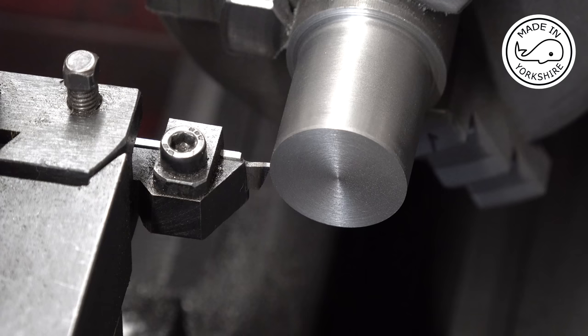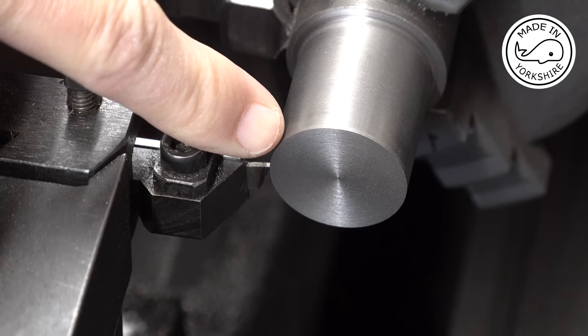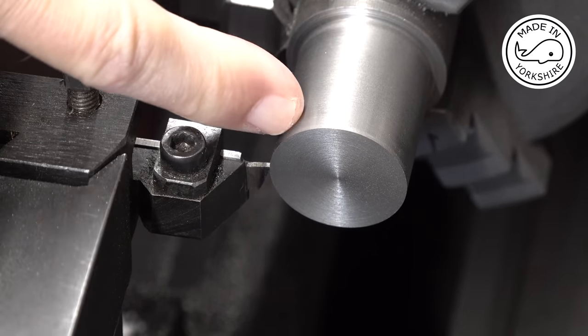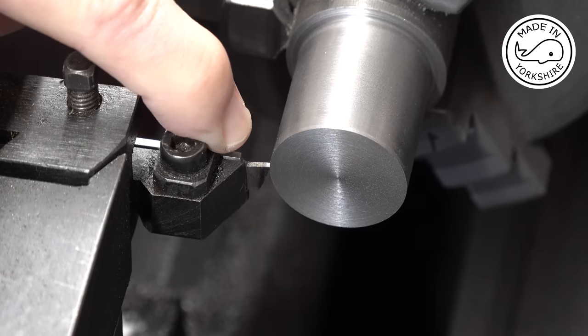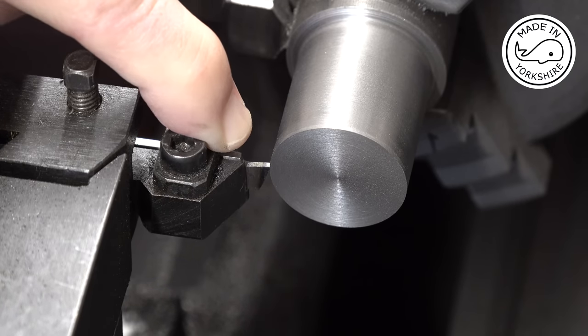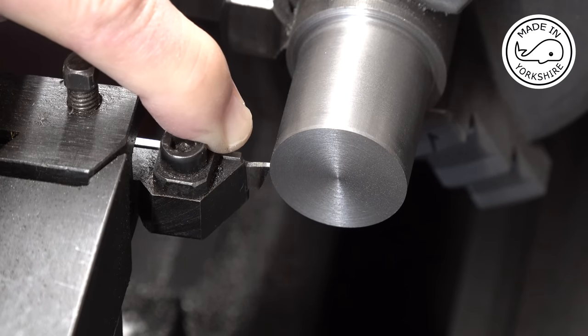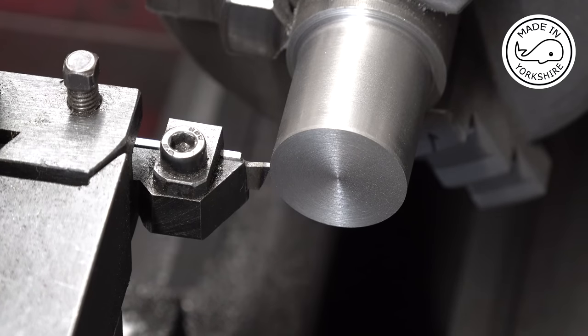So my piston rings are 36 thou wide and 36 thou deep. So what I need to do is to cut a groove. The first groove is, let me see, 55 thou from this front face. This parting tool should be 36.5 thou wide. I think it's closer to 37, but I think it'll be okay. And I need to cut to a depth of 40 thou.